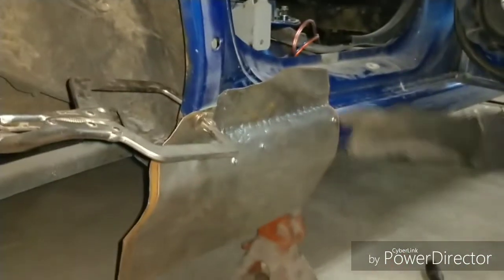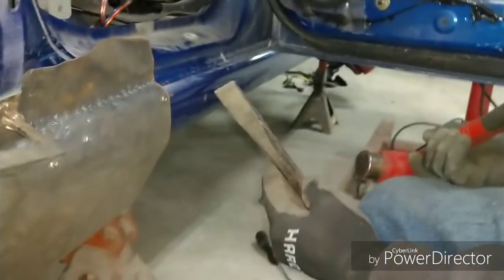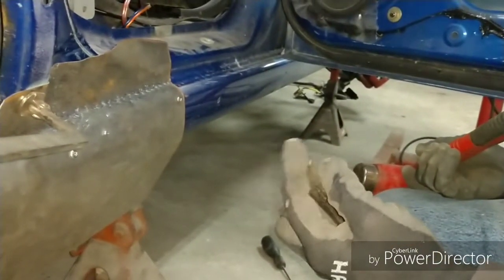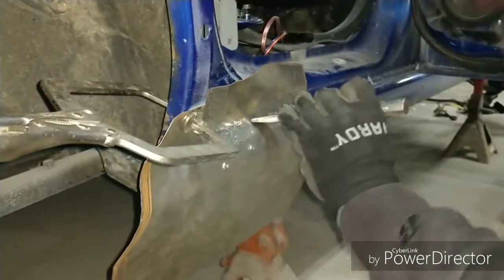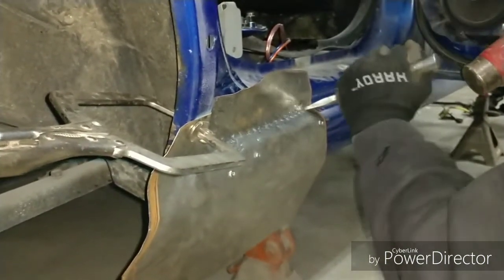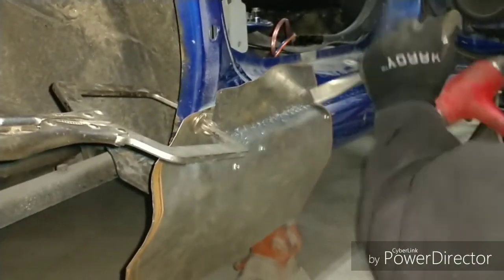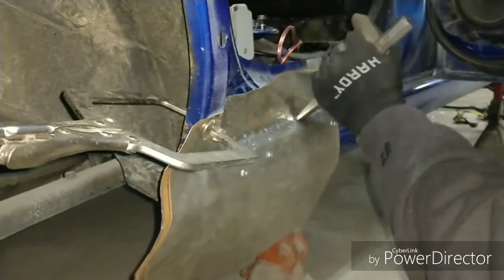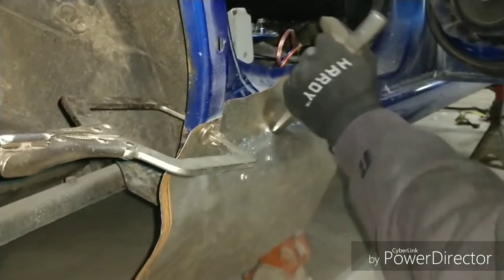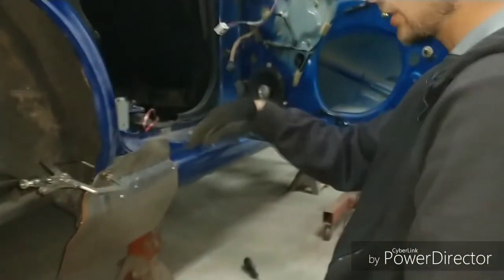Okay, so to get this pitch here, I actually use a blunt chisel. That's usually probably your best thing. Just go ahead and grind off the actual face itself so it's nice and blunt. And then you can slowly manipulate the metal into that pocket this way and downwards to stretch that area. You want to work from the edge in. That way all of it is able to pull the metal or stretch the metal that they need it. Slow, methodical process, and then you just basically work yourself right up into that edge.